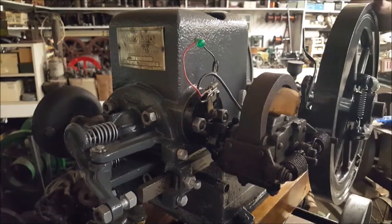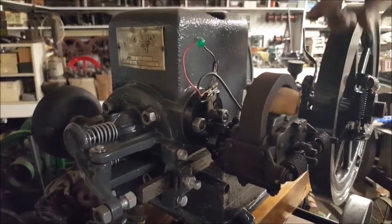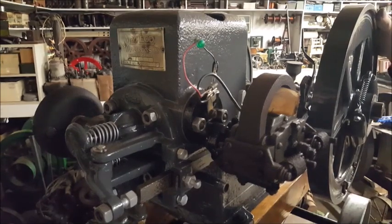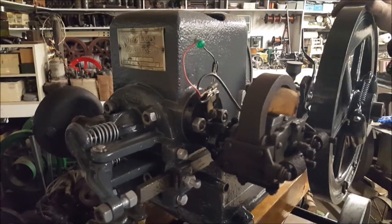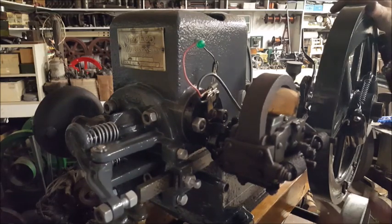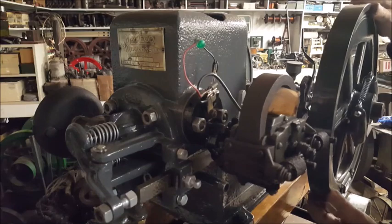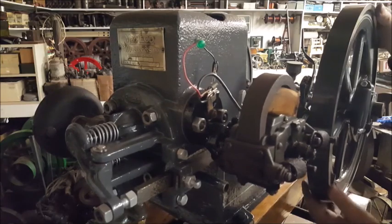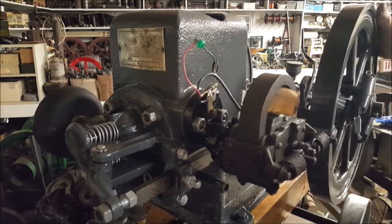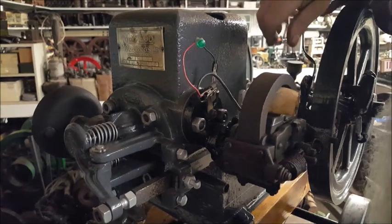You come around like right here, and when the engine comes around on compression, we'll see a spark up here when it trips this magneto. And it is coming up on compression. If you've got a good spark, you don't have to be cranking hard on these engines. If you've got a good check valve and good compression — carrying on — it does have some pretty decent compression. But we're coming around. Did you see that spark? Did you hear that snap? That means the igniter in there fired.